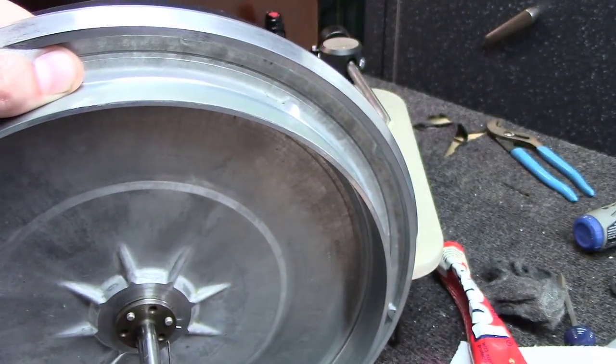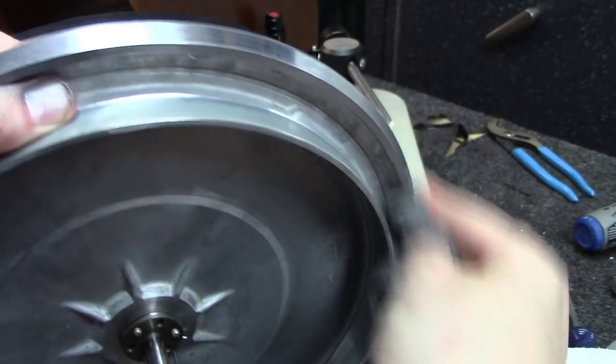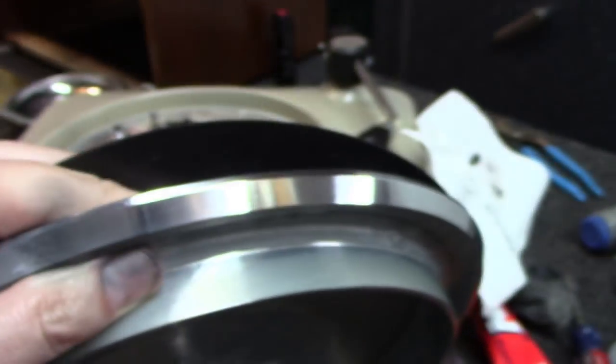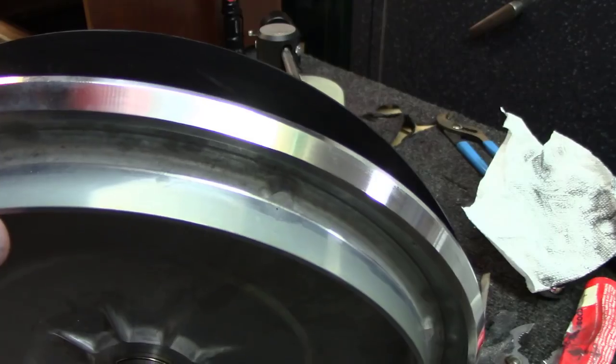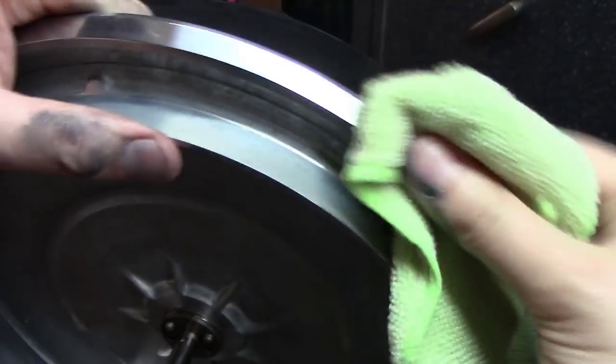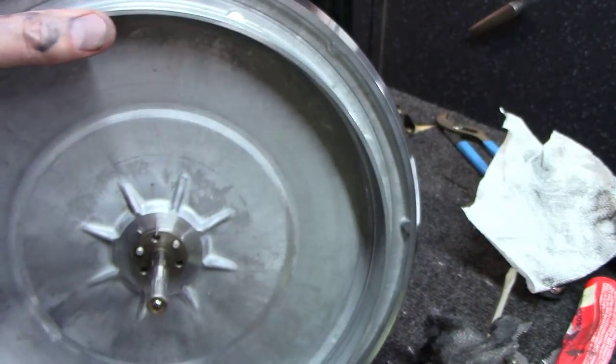And you want to keep applying the stuff to your steel wool, kind of rub it around a little bit. You don't want to do it dry. And you just keep rubbing, buffing, buffing. There's no simple quick way to this, because you've got to get the layer of oxidation off first. Once you get all that done, then you can go over to a buffing wheel and polish it up to a real mirror finish. But you can't start with the buffing wheel and get all this oxidation off. Check that out. Looking great. All right. When you get it all done, you can use a polishing cloth some. Make sure you get off all the old residue. But you see this thing's looking great. I had to take a break.